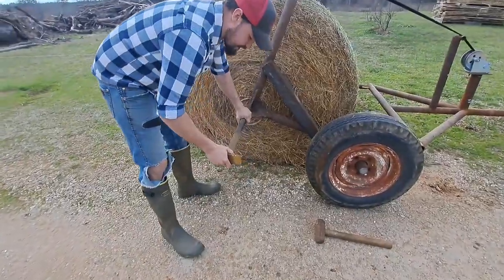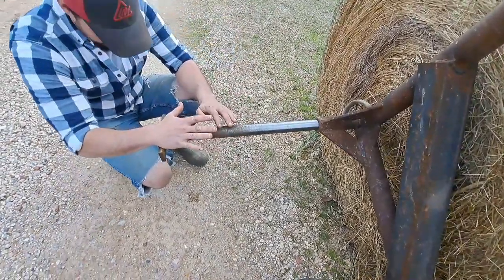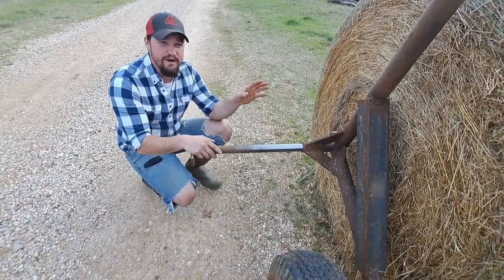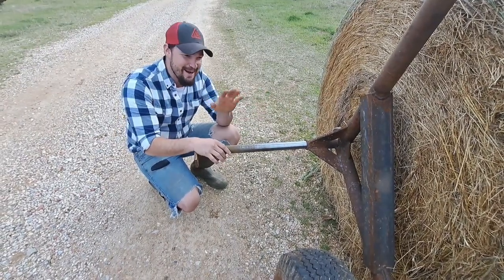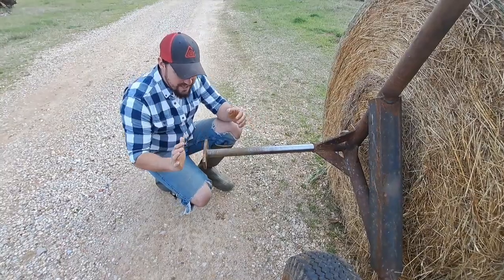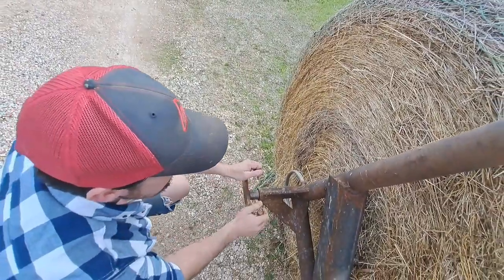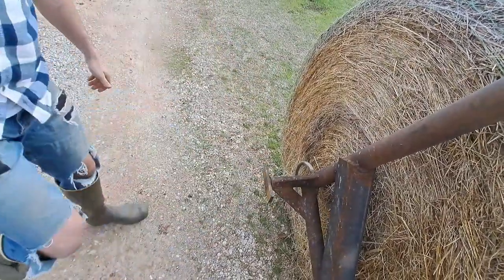Another thing I did on this bale unroller is I put a nice thick piece of steel on here — this is half-inch thick steel. I've seen a couple other people where they could just take the spear and put it right in there. I changed that because our bales are very tight. Not all of them, but where we're getting them from — her dad does not play around, he gets a good tight bale. Some bales are going to be tight enough it's going to be hard to get in at that last bit. So I did it like this: you've got a handle you can twist it around on, and you've also got a nice thick pad so if you've got to hit it in there, you can. Every now and then you can grab it and twist it to get it back out.